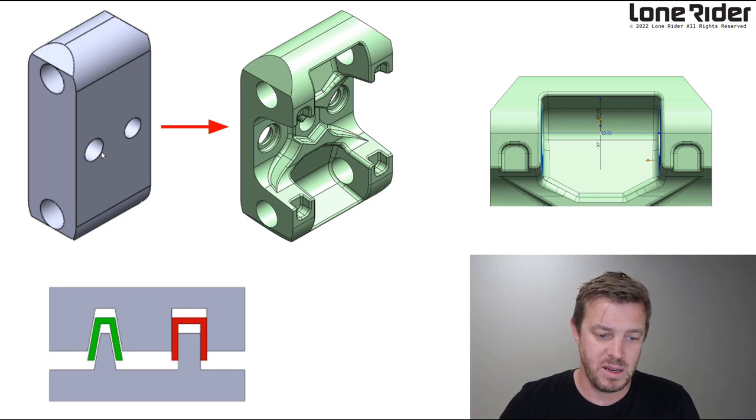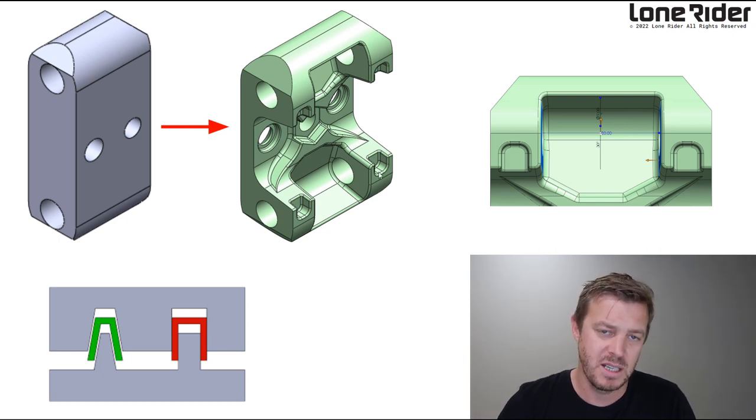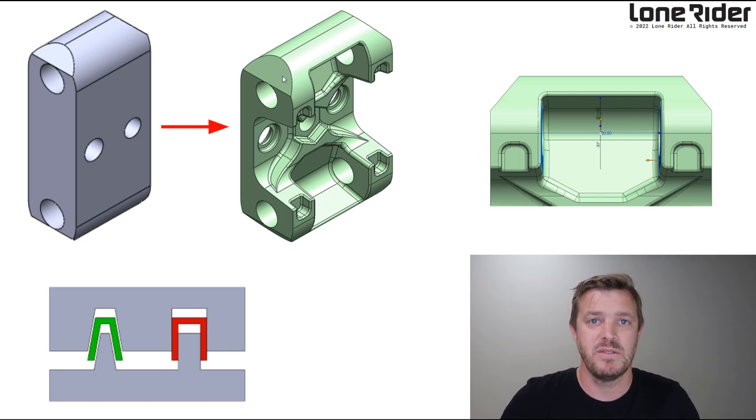And then if you go into the next one, the green one here, this is basically the same thing. But what we've done is we've designed it for manufacture. So here you can see that we've opened up a place for bolts, we've added in poka-yoke features so things can only go in one way, and we've reduced the material so the machines can actually injection mold this. I can see there's a little bit of an error here, but that's because we're still developing this part. So that's the difference. That's just design and making it work.